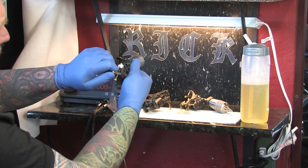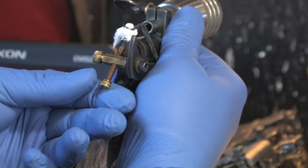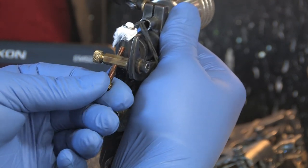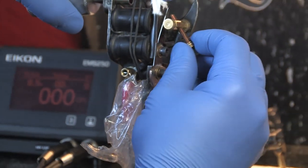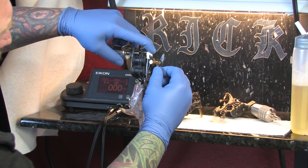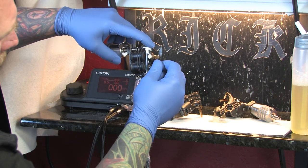On your rear binding post here, you have a little contact adjustment and a tightening screw that allows you to move this part back and forth — your little contact screw. This contact screw adjustment comes away from the spring and goes to the spring, so you're basically opening or closing this little gap between your front spring and the contact point.